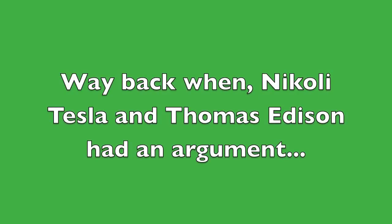If you know your history, way back when Nikola Tesla and Thomas Edison were at odds between AC and DC, Thomas Edison argued that AC was dangerous. Nikola Tesla said that DC had excessive voltage drop. Well, that excessive voltage drop is still an issue today, and it is the reason for this video — because you may not have sufficient voltage going to your taillights on your towed vehicle or trailer if the wiring is not sufficient.